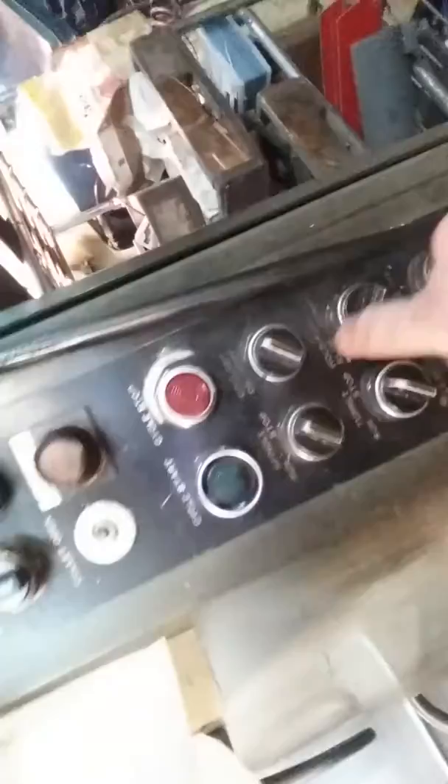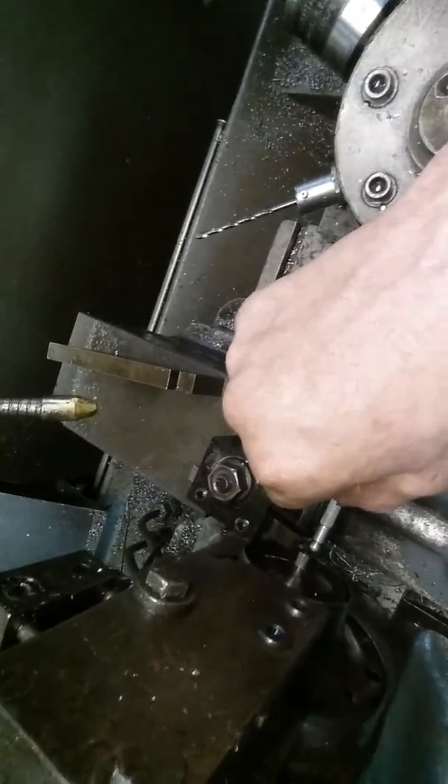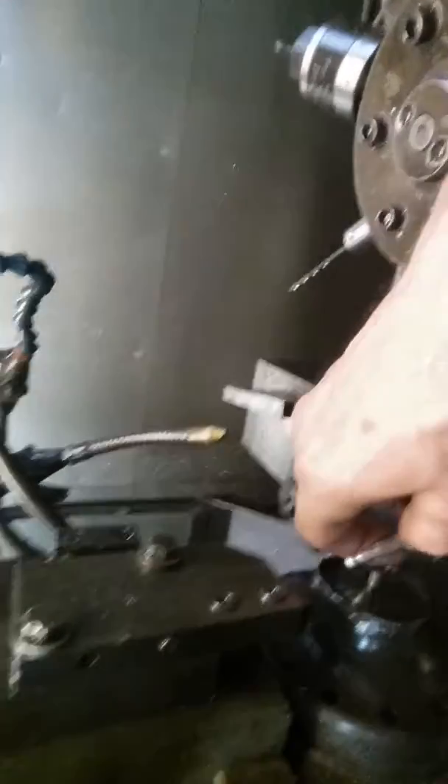I'm getting my new Samsung phone all oily so I can show you how to do this. We're going to put the turret slide on hold, then advance the rear cross slide. It's coming forward. Now you can get a rough set for our tool for the spot we want. I'm going to use the stop screw to back it up so it's going to cut the notch I want based on the material I have, and cut that shape in there. Then the cutoff tool will finish the cutoff — I'm going to cut that shape in and then deburr with a spinning tool or drill.